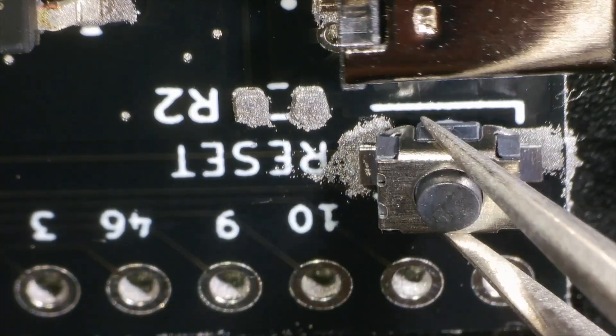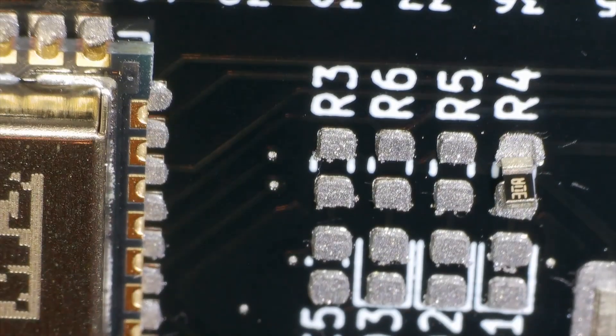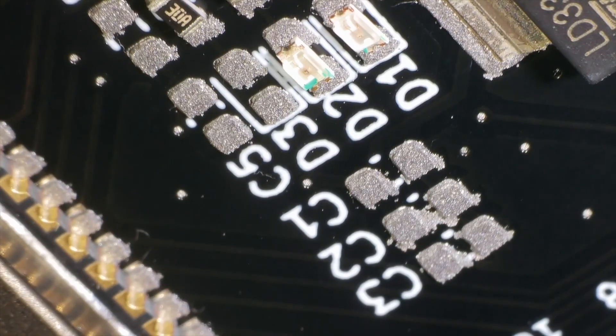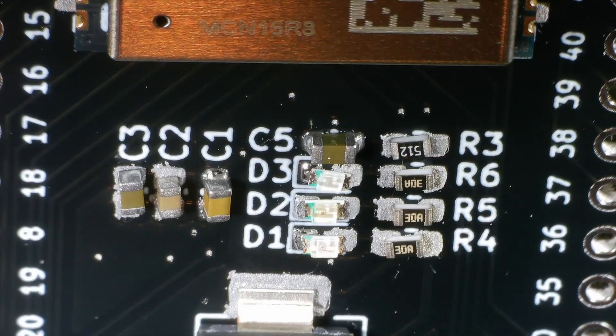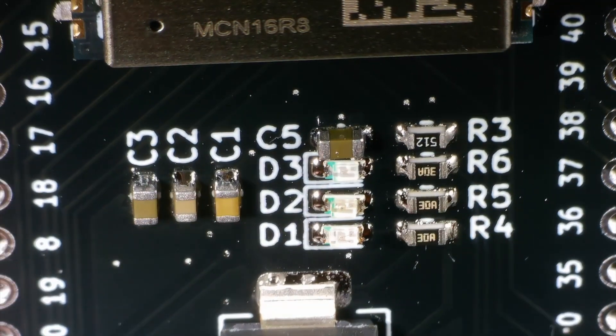So we're just placing all the components: here's the buttons, there's a bunch of resistors, some resistors for the diodes, so we'll stick those on. Here's the actual diodes - I think these are red, green and blue, may have got those mixed up though. Bunch of decoupling capacitors to stick on, and then we're pretty much done. Stick it on the hot plate and heat it up. Everything jumps nicely into place.